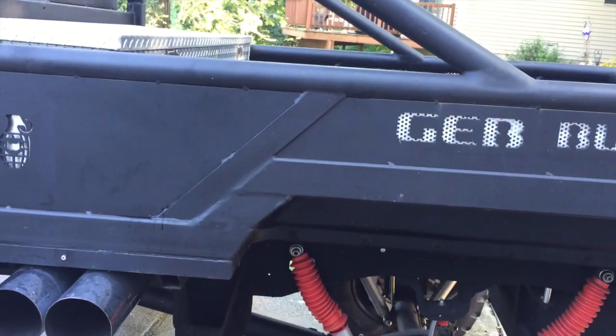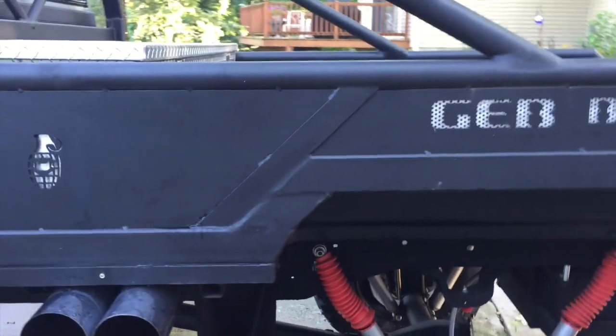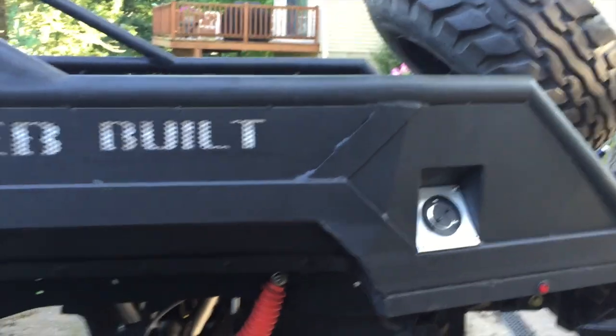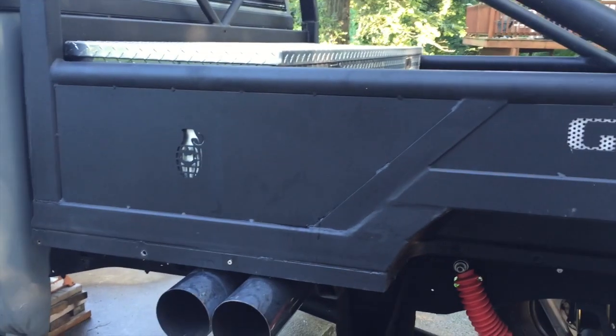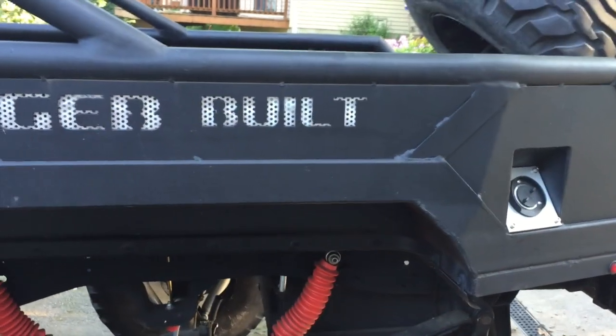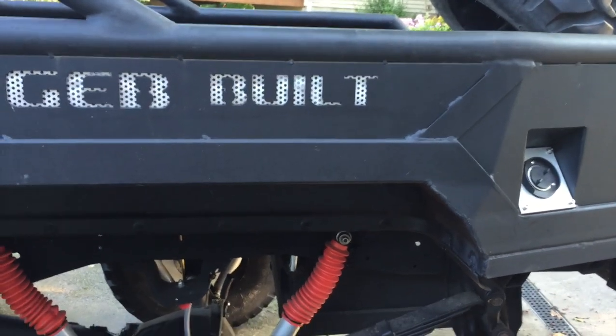And as I was going, I thought, well, this is going to be pretty cool to kind of split it up a little bit instead of one big panel. So I welded some flats, one here and one here on there, and that also gave me a good place to seam the filler panels, which is what this is, and this is. That's all 1/8 inch flat steel, sheet steel, nothing fancy.